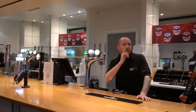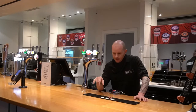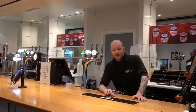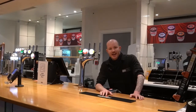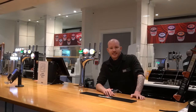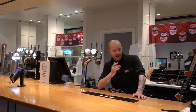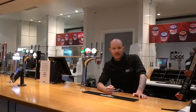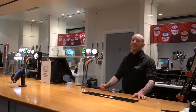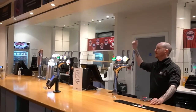So what we are doing — we have three roller doors fitted here so we need a power supply for them. We're going to run a power supply either from under the bar or over there. We've got to go through the task of finding out which one of the many many fuse boards it's fed from and where that even is. We'll isolate it, run some power probably up one of the pillars because there's already some trunking here with some data, so we're thinking of doing a similar thing — obviously in separate trunking, segregation of band one and band two cables — and then run a socket up there and a socket over that side, and plug these in.